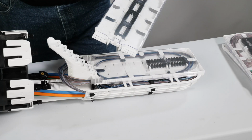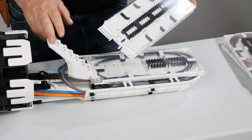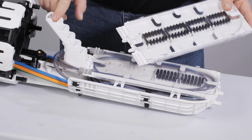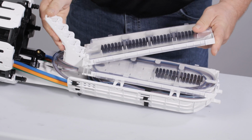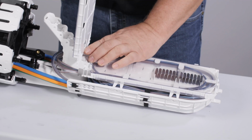To install or reinstall Apex Splice trays, install in the mounting holes on the yoke. These should be installed sequentially if possible to prevent trapping a tray from being removed later. All trays must be filled from the bottom up. There can be no empty spaces between trays. Simply engage one side of the tray in the mounting hole and rotate it to engage in the second hole. Lift the tray and then release to its resting location.